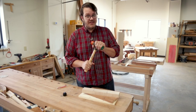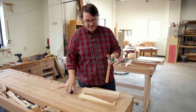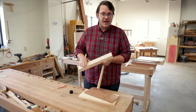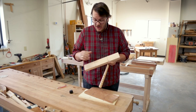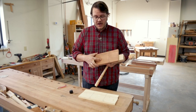All right, so that was a pretty fun test. I've got my Lixie here set up for probably how I'm gonna leave it set up. I've taken the black head off. Even on the maple, I felt like the black head might do a little damage, and generally when I'm assembling something, I don't wanna have to go back and replane surfaces. That's a pain. So green was definitely safe on the maple, and green was also safe on the cherry.